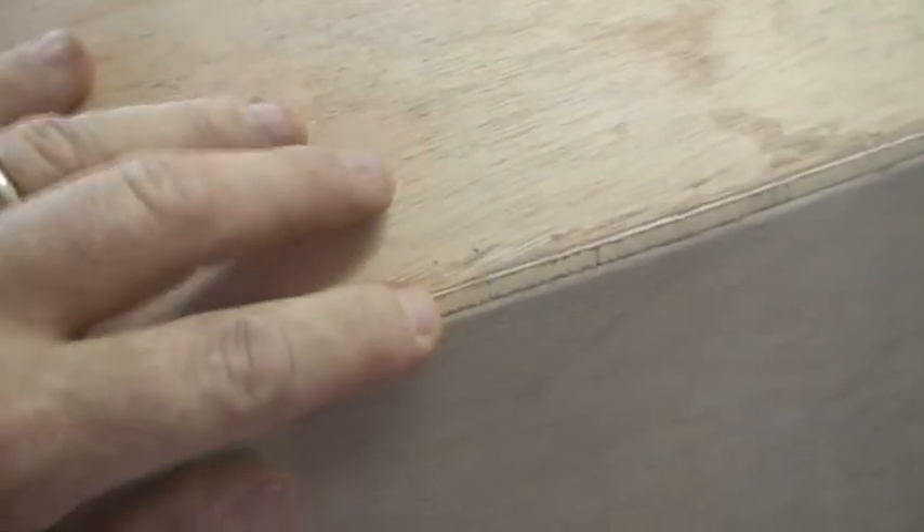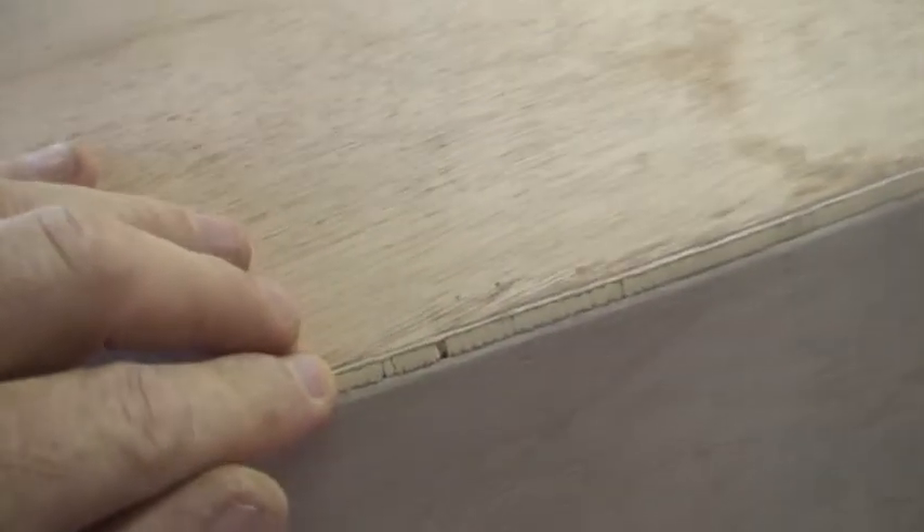What we want to do is make sure, as we're doing those epoxy coats, that we treat these edges of the ply with a good amount of epoxy — because if there's anywhere that the ply will start to give away, it will be at the edge. There are some places where we've got a few little voids and we'll need to fill those up. But all in all, it's getting very close to our turnover time.